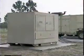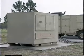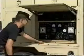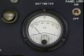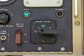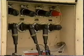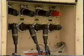As previously mentioned, the MEP-12A electrical power is fed directly to a primary or secondary distribution center. Load at these centers must be shut off first. Generator shutdown procedures may begin when there is less than 50 kW or no load on the unit. Turn the breaker control switch to the open or trip position. A green indicator light signifies that the main circuit breaker is open and the generator output power is not being provided to the load terminals.